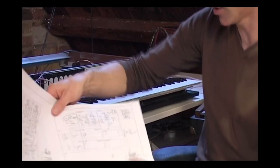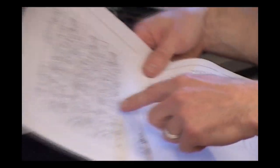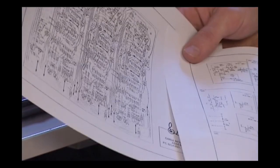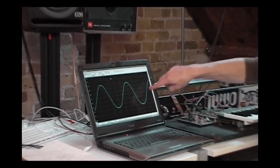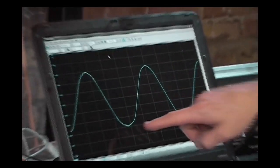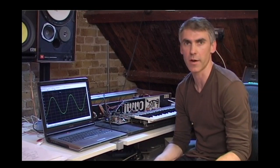So there's the schematic — that's the land that I live in in theory, and then when I want to find one of these bits and have a look at it, I have to find it over here so that I can find it on there. This is the LFO driving the chorus module on an ARP Omni. You've got it kind of coming up and bending and then back down again, but there are little pointy bits here. It's exactly these kinds of non-symmetric shapes — the top half is different to the bottom half — that give analog a lot of its character.